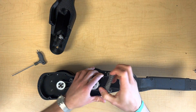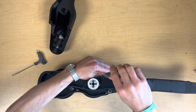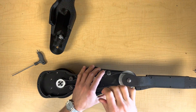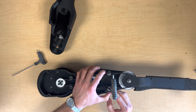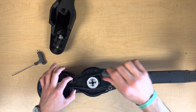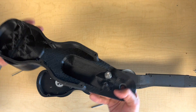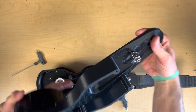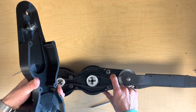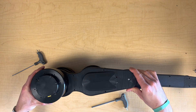After I've added those, like with the shank, we can rotate these eccentric idlers a half-turn. This pushes the bearing in towards the belt to tension it, and then we tighten this M4 bolt back to keep the eccentric from rotating. For the upper ankle belt, it'll be using the same system, but since it's such a short belt, we can accomplish that just by tensioning one side. When we add this top half, we'll need to pre-tension one side of the belt so that the other has enough slack to wrap around that idler pulley.